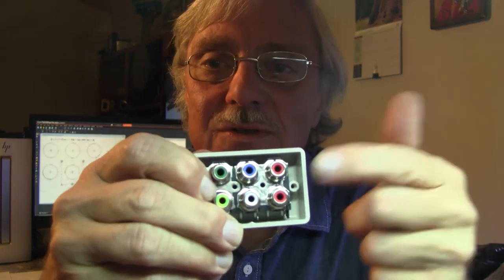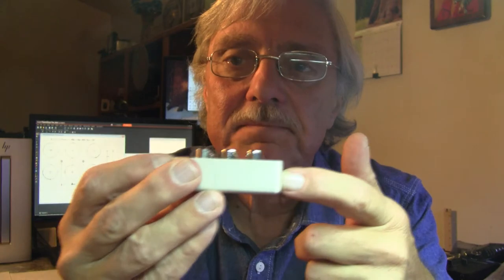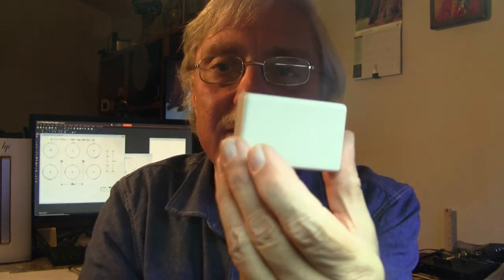It will center up, though it's having a little trouble getting to vertical center because of the pins on the bottom — but we can trim those off. I'm going to have the wires enter from the side, and that will be our breakout box, with the mini-DIN plug at one end of the cable and this connector inside. I'm going to drill the holes in this piece — that's how this is going to work.